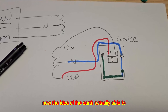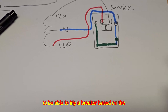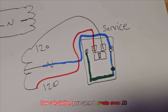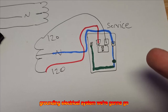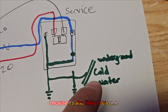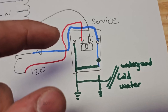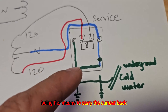The idea that the earth can actually trip a breaker because of resistance is not true at all. You can't generate enough ohms to trip a breaker based on the resistance of the earth. We attach to the earth as kind of an equal playing field — a potential — but the earth serves no purpose in tripping a breaker. Ground rods are based on 25 ohms; if you do the Ohm's Law calculation, you cannot create even 20 amps to trip a 20 amp breaker. But for a completed grounding electrical system, we show some ground rods and a cold water ground. Anything metal that is attached to something electrical must have a reference back to the source — the source being the neutral, the grounds being the means to carry current back to the neutral.